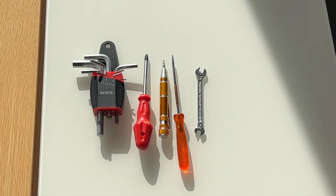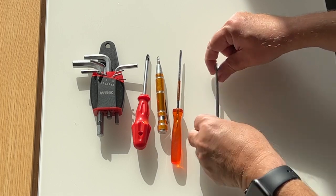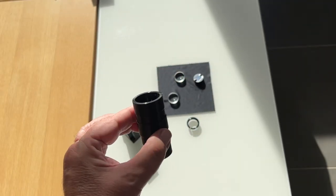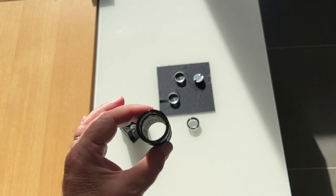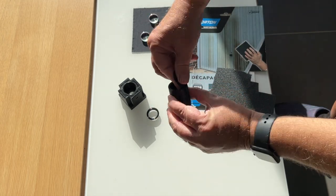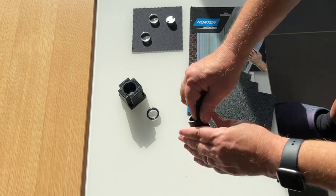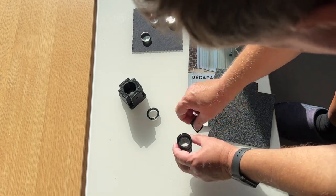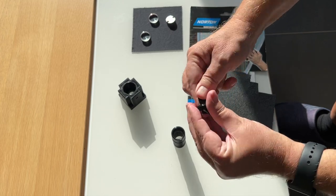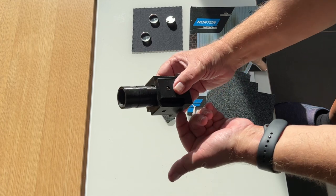To carry out the assembly you do not need many tools: a set of Allen keys, screwdrivers of various sizes, and a wrench. The first element to assemble is the tube called the collimator tube. Be careful — there may be small chips or burrs because of the 3D printing process. You have to remove them completely with abrasive paper by rubbing. Avoid putting dust on the lenses. You can rub all parts, even the small slit washer, to remove printing threads. The interest is ease of assembly and to allow the parts to slide well without hard points.